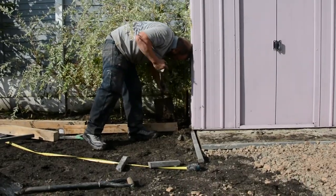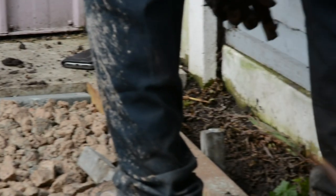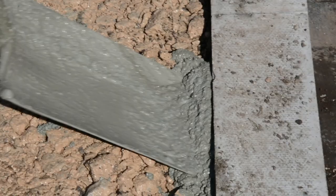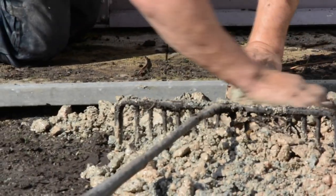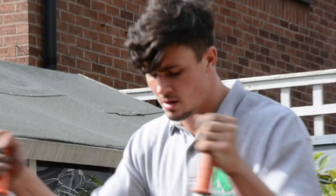Phase one of installing Canine Turf is the groundwork. Around the perimeter of the Canine Turf lawn we use two inch by two inch solid plastic rails. These are crucial in installing Canine Turf as they will not corrode with the elements — rain, cold, etc. Initially we put down Type 1 MOT to a depth of 5–8cm.